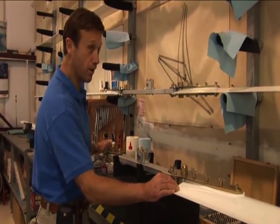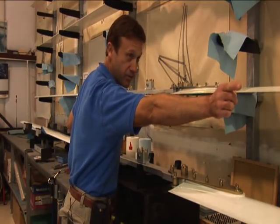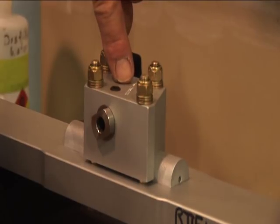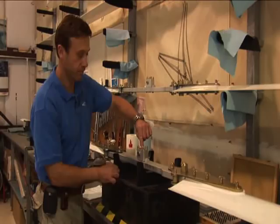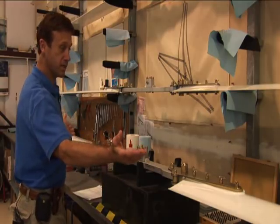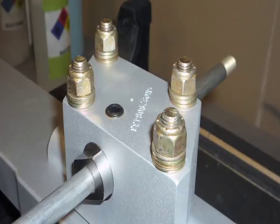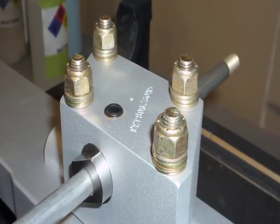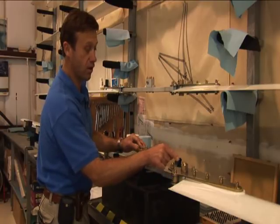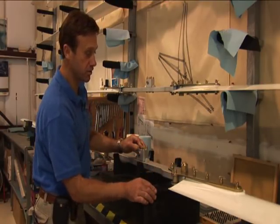If you wanted to check stringing, you'd put a string from one end of the blade in the center in the same place and run it all the way through — that's what this dot is for in the center of the pitch block. All the way to the other end: if each blade tip is slightly up, the string will run right through the center. Because of the urethane damper right here and the spherical heim joint inside this hub bar, the blades will find their true position by themselves.